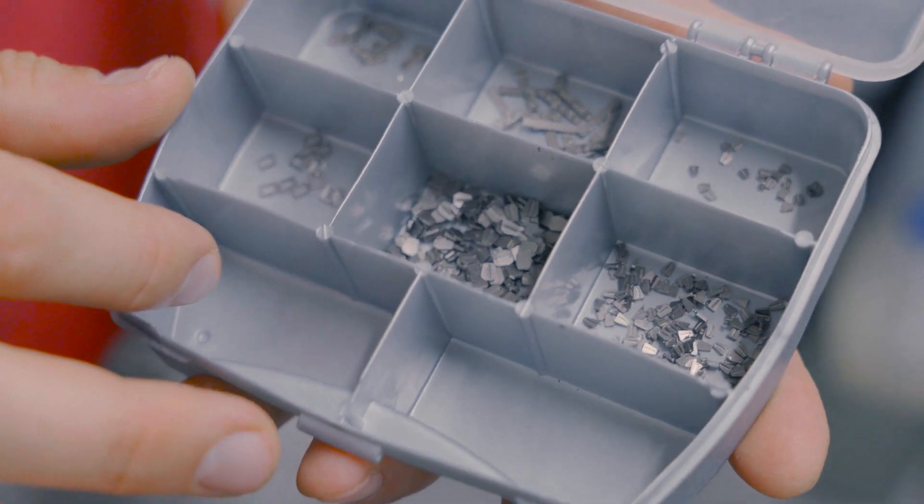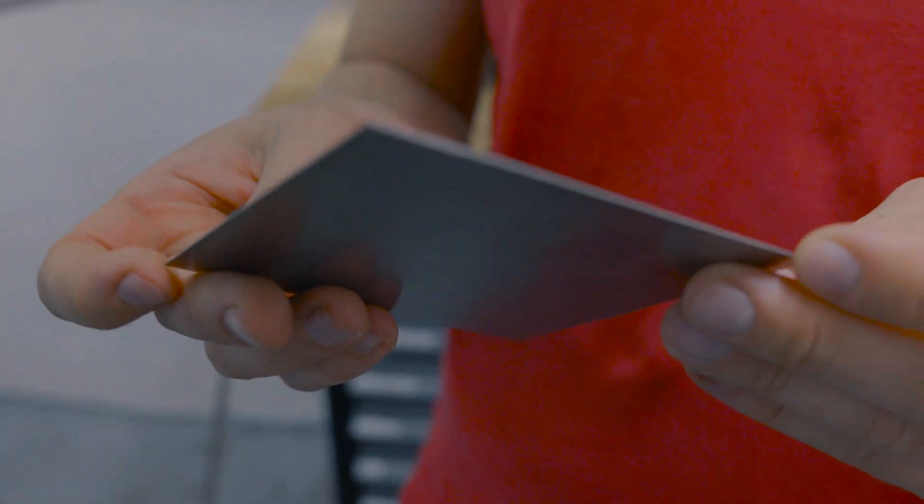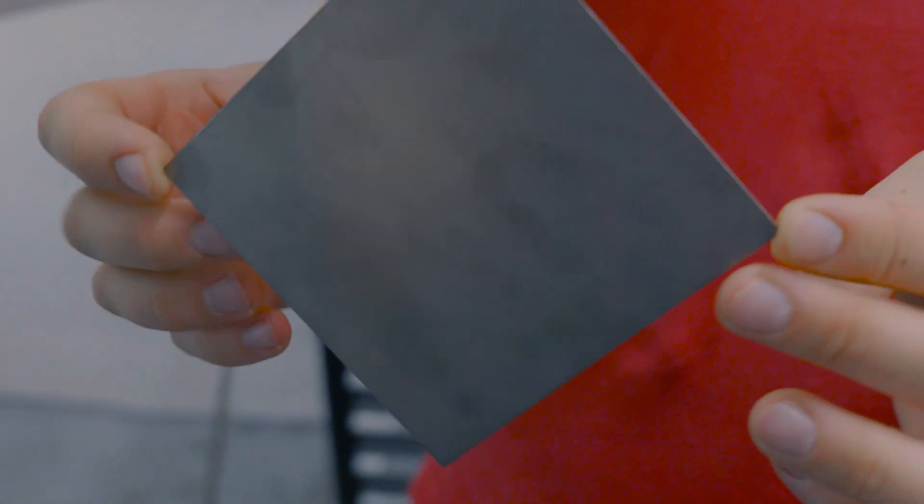As you know, we make most of the parts of our watches in-house. We also make the dials and the indexes. They are machined out of a thin sheet of titanium just like this, and when they come off the machine they are a bit rough around the edges. They need a lot of love from the goldsmith Carolyn until they are shiny enough to be put on a dial. To make her life easier I came up with a little jig for holding the indexes for polishing.